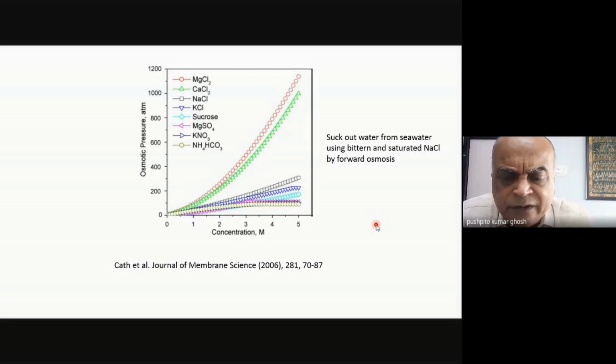Like we discussed, if you produce salt, then you get a mother liquor, which is sea bittern, and that is highly concentrated in all salts. Most of the sodium chloride comes out, but after that, it is very rich in magnesium chloride and magnesium sulfate, because these are soluble salts and they don't come out. So they will remain. Then there will be some uncrystallized sodium chloride, a small buildup of potassium chloride, bromide salts, etc. And let me tell you, the magnesium chloride concentration can be as high as around 200 grams per liter. That level of concentration could be even higher.